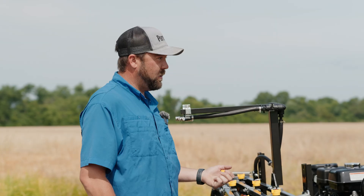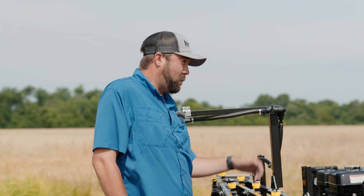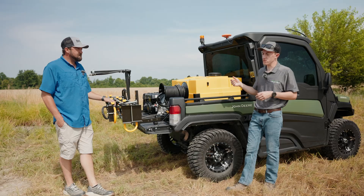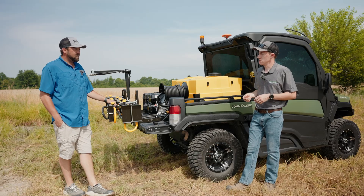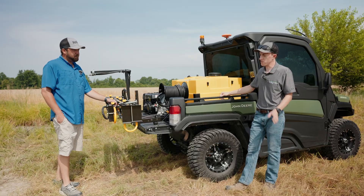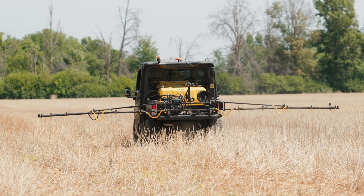With a 22-foot boom, I know that when I come out and crank the wheel all the way I can nearly get right back on my line — so it's basically close to a 22-foot turn radius. That turning radius is really important, especially if you're going to use the manual U-turn feature, whether with the controller or pressing it on the screen. That's how the system determines how wide it's going to turn at the end of your row.